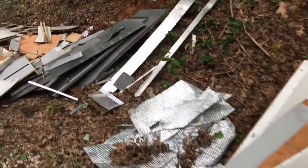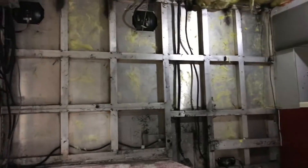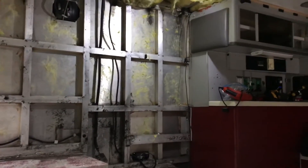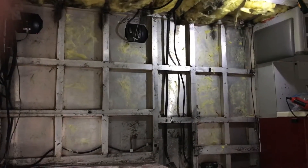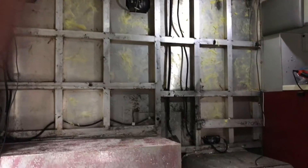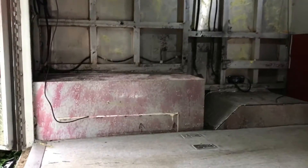The piles are just growing and growing. But I made an executive decision on the inside. I got down to just the wall board and I tried pulling out those little staples — that just wasn't going to happen. So it was just a matter of a couple bolts and those boards just dropped right off the wall. That was much simpler. This way I can pull out all the old insulation, put in all new, bleach everything, seal all the lights, and not have any surprises in the wall. The black stuff you see is soot, not mold — just soot from being around fires for 13 years. Now I've got the box uncovered.